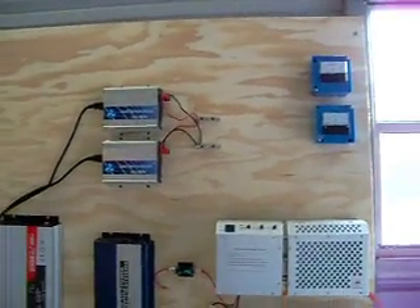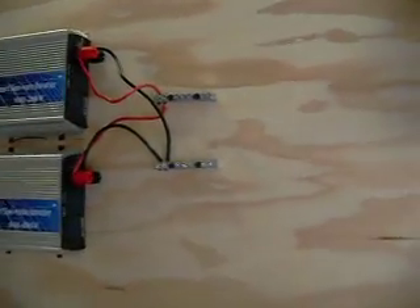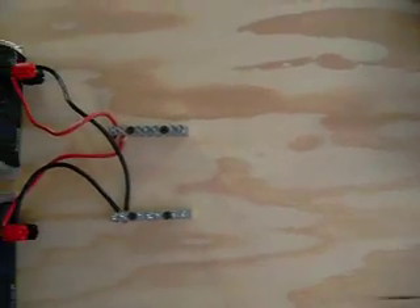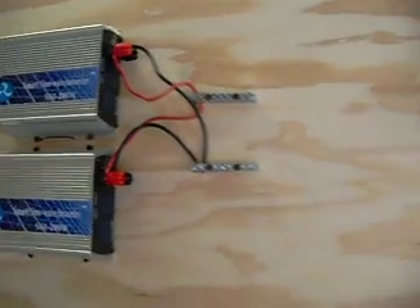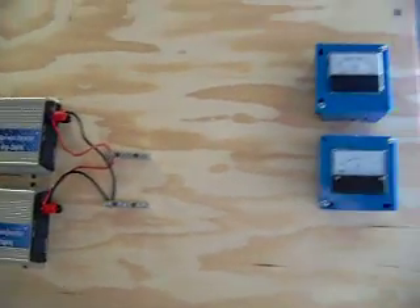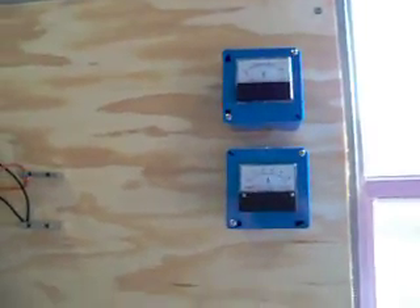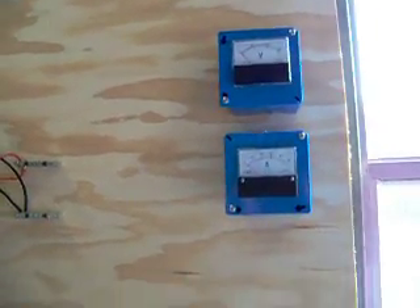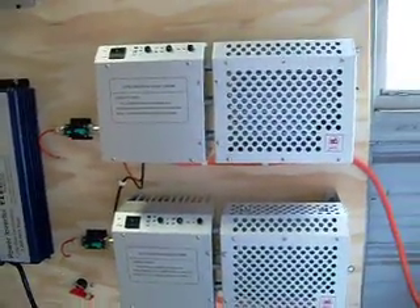In another video I was talking about how I'm going to connect the solar panels from Harbor Freight. They're going to come into this amp meter and then out into these two power strips there, and from there to the grid tie controllers. There are two 200-watt controllers, which is fine because I only have 330 watts of power from those small 15-watt panels that come in from Harbor Freight — I got a total of 22 of those, which is 330 watts total. I'm going to be able to monitor my solar voltage and amperes through this.